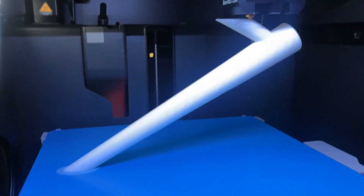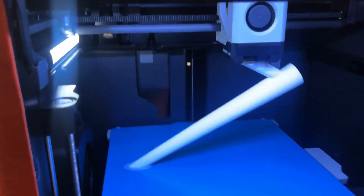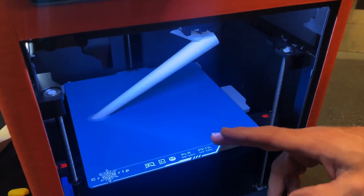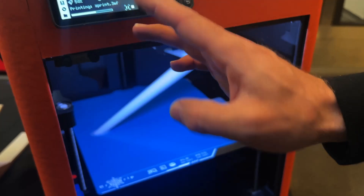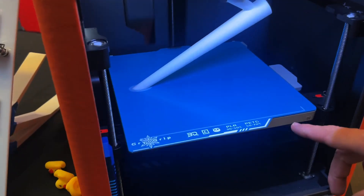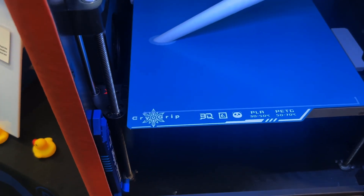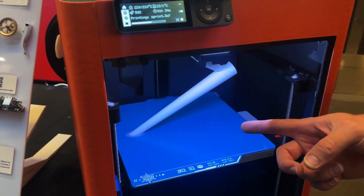That's impossible, you would think — and yet here we are. So that's our Cryo Grip. This is the Frostbite. It supports PLA and PETG officially. Unofficially, I've personally tried it with a couple of blends of ABS and ASA and had really good results — we don't advertise it as supporting those because some blends may leave a mark, but definitely PLA and PETG. Zero heat for PLA on crazy prints like this, and PETG at low heat — doesn't need normal PETG temps and it just sticks like crazy.